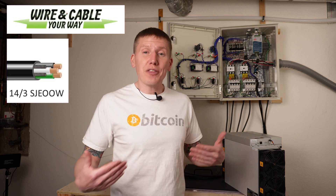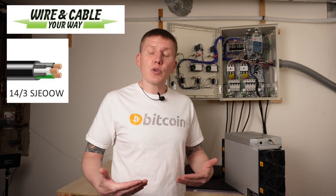Going below further, we have my cables going out to my miner. As we talked about in the last episode, it's really important to get cables that are compatible with your dielectric fluid — otherwise the cables will fall apart over time, short out, and create lots of problems. When I looked for cables compatible with Bitcoin immersion mining, I really didn't find any good options that would sell a one or two miner setup; most vendors were selling for very large quantities towards industrial miners. This space is changing quite fast, and I imagine there will be a vendor soon who will sell a one or two miner cabling setup. However, if you do want to make your own cables like I did, a vendor I've used is Wire and Cable Your Way — they have pretty much any wire and cable you can think of and they'll sell it to you by the foot.